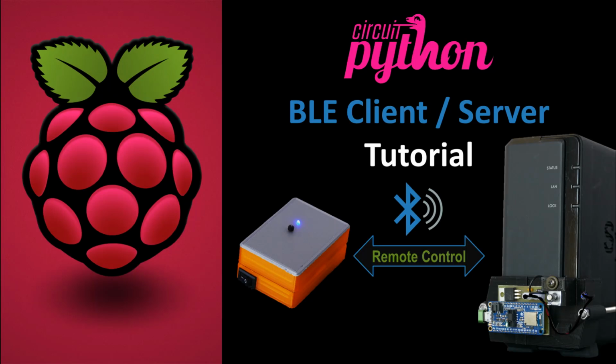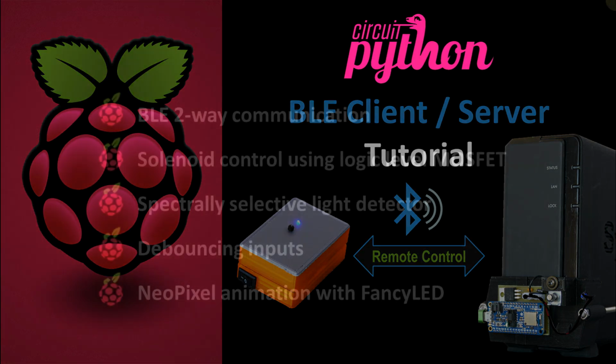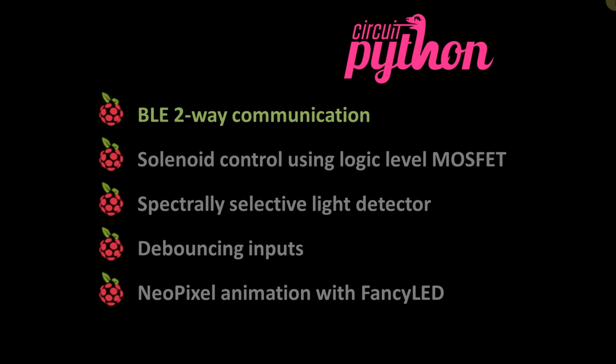In this CircuitPython tutorial, I'm going to build a battery-powered Bluetooth BLE remote control to operate a BLE peripheral that hosts a solenoid and a light detector. This will be a fast-paced video, but a full write-up will be available online, which will be linked in the video description. This tutorial covers BLE two-way client-server communication between two nRF52840 Feather boards.